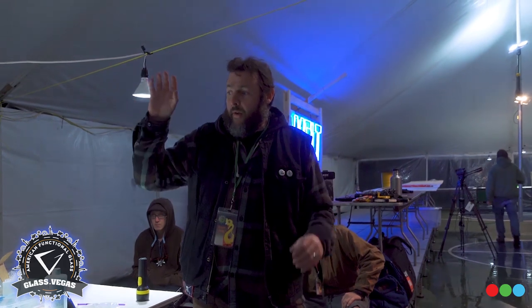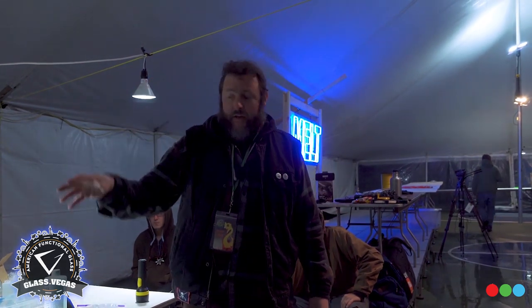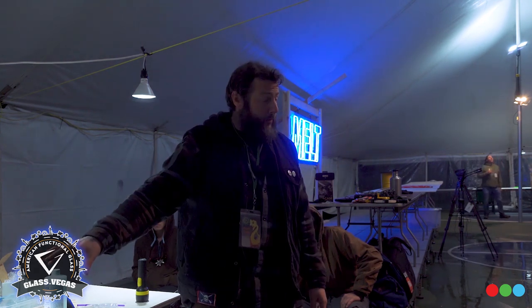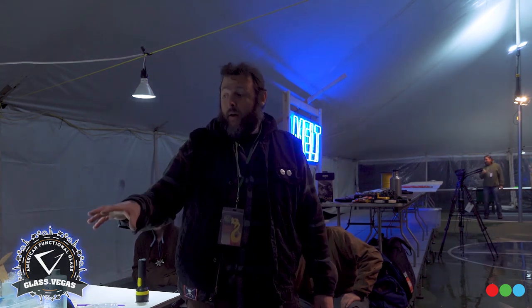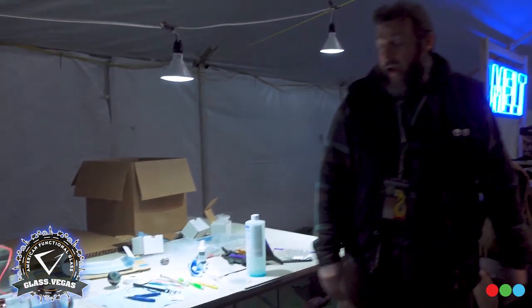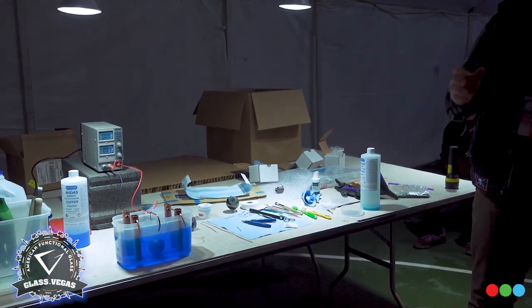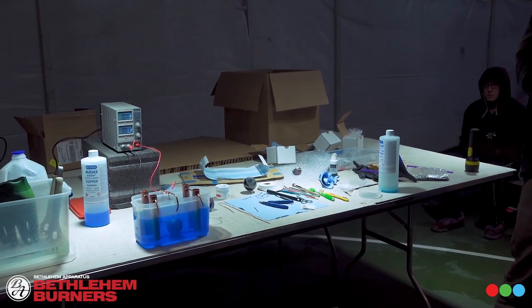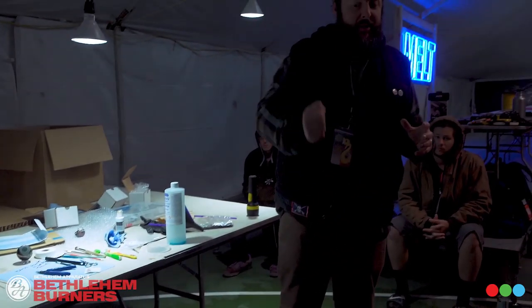I should say inexpensive. But then the precious metals, silver and gold, not only do you use a different solution made specifically for it, you'd have to have the gold or silver anodes. And I think that the copper itself is already conductive enough that you don't have to paint it with a conductive paint or anything. And it's more of a dipping, right?